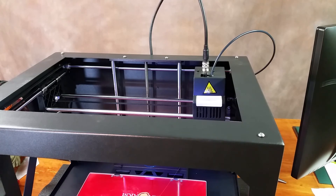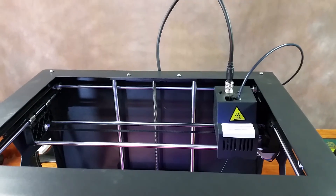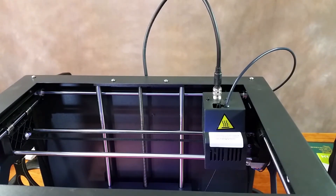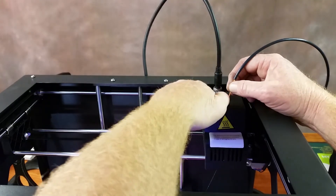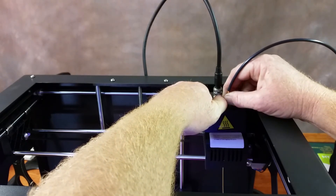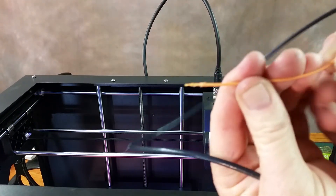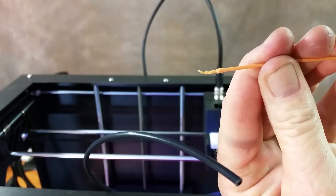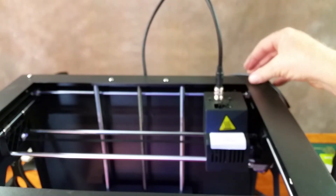Let it warm back up so I can go ahead and remove the filament. I'm up to 178 degrees — I should be able to go ahead and remove it. I'm going to extrude a little bit of plastic and then pull it out to clean the nozzle. You can see it's got pretty much the shape of the nozzle right there. Let me go ahead and lay this back and run the new filament through.